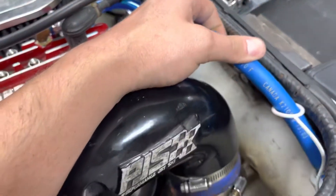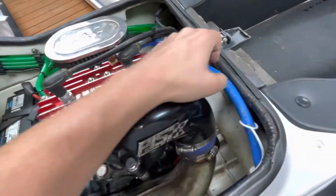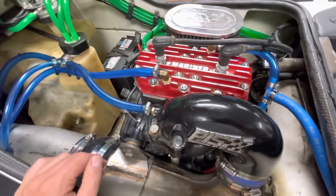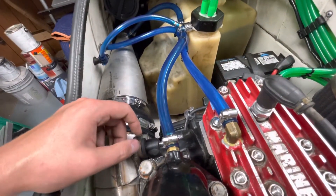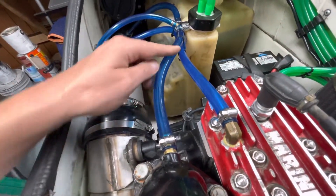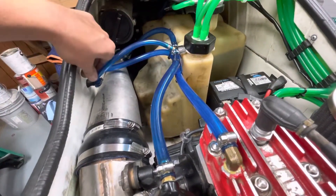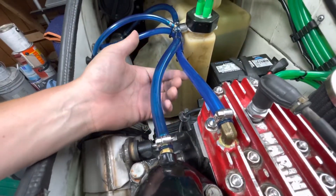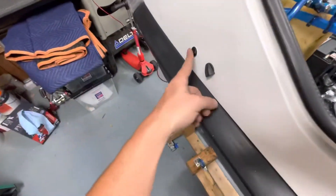I also took the moment to add a hose adapter here — should come off a garden hose if needed — it just seemed to fit there and I had one. I ran dual cooling out, so we have one half-inch in and dual three-eighths out. The original outlet comes here, and I made a little bracket out of zip ties going to the original pisser and back into the exhaust. The second port comes out under here and goes to another pisser.